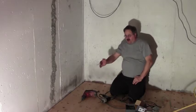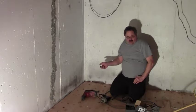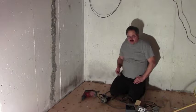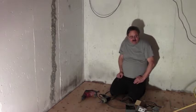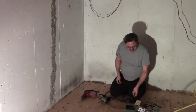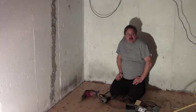We just go from hole to hole. Now we're going to start along the wall here where we started laying our plywood, and we're just going to go systematically right across the floor, and every single hole where we piloted, we're going to sink one of these little pins. After that, this floor isn't going to move. It'll be just as firm as the concrete down below, and you'll have a nice insulated floor.